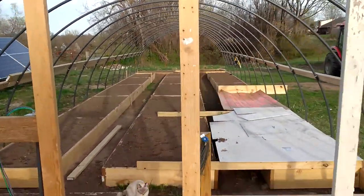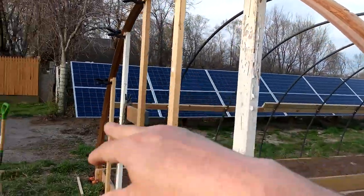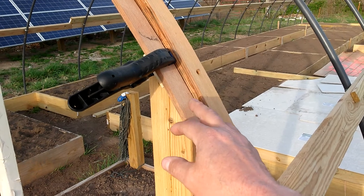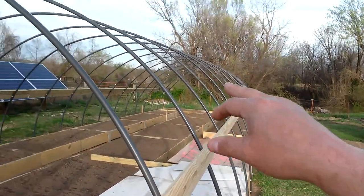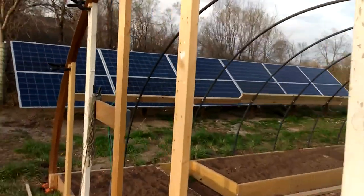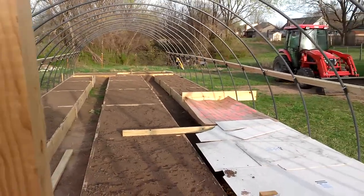That is hoop house 101. I'm running out of daylight — I want to glue the beginning of the end wall to my starter blocks, get it unscrewed, and move it down to the far end. If I can get the uprights up before it gets too late, that'll be a good start for tomorrow, which will be day one of laminating the second piece. Once that's done, we'll do the third piece. Then I need to finish the hip boards on the far end, and we'll be ready for the center spine and the top — which will be a bit tricky at eight feet tall in the center. I'll probably have updates. Thanks for watching.